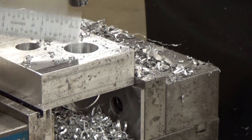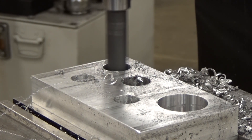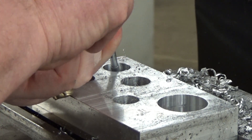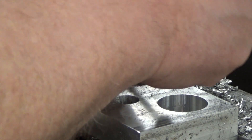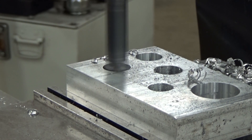I'm going to go ahead and fast forward through most of these holes — you can see we're still not even quite to an inch yet. I decided to start on this hole because it's close to the three-quarter; it's a seven-eighths diameter hole. I'm going to set it to three-quarters using my telescoping gauge, which we'll go into more depth on in another video. So right there we've got it at three-quarters of an inch.